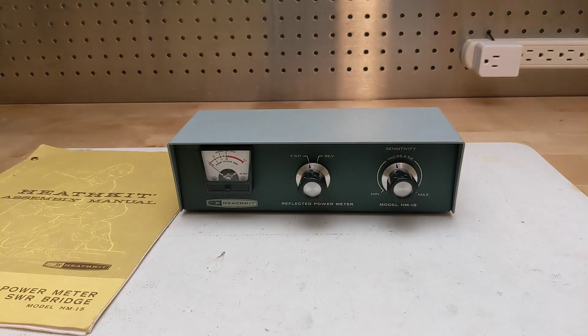The sensitivity of the meter — the minimum power needed to measure SWR — varies with frequency and is more sensitive at higher frequencies. The manual gives sensitivity ranging from 70 watts on the 75 meter band (the high end of the 80 meter band) to 2 or 3 watts on 6 meters. I measured the approximate power needed on each band: 160 meters (1.8 MHz) was more than 100 watts; 80 meters at 3.5 MHz was 77 watts; at 4 MHz was 59 watts; 60 meters was 35 watts; 40 meters 20 watts; 30 meters 11 watts; 20 meters 7 watts; and on the 17, 15, 12, 10, and 6 meter bands it was less than 5 watts. These measurements are in line with what the manual lists for sensitivity.